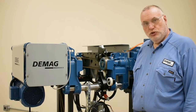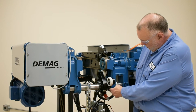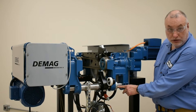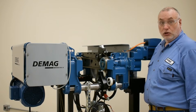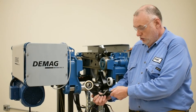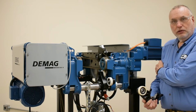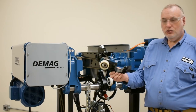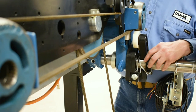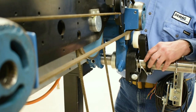The next important design feature and improvement over previous designs is the thrust rocker and the hub on the thrust rocker. Notice it is pushed and kept next to the side cheek by a clamp. Another clamp is located here on the side cheek. There are no longer spacers put across the load pin. The hub of the thrust rocker is a C-shape, which allows the two halves of the scissors to come together around the load pin — no longer requiring pulling the drive unit off the load pin to change a thrust rocker. This is the new wraparound design. Please note the white cable tie used as a secondary drop stop on the thrust rocker halves. It comes installed as the two halves come in their package — please retain it and keep it as a drop stop. Do not cut it off.